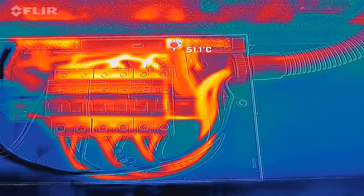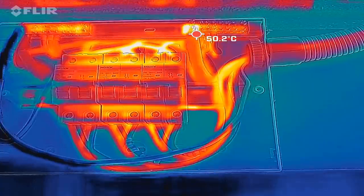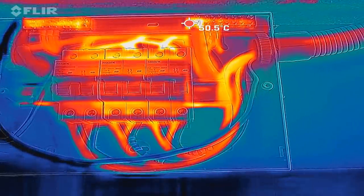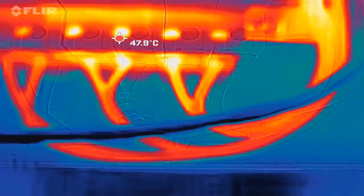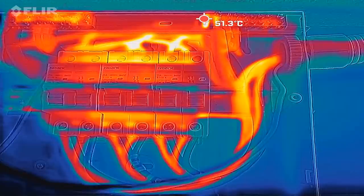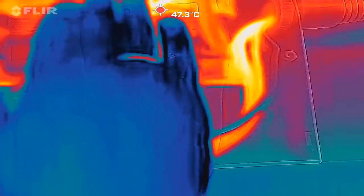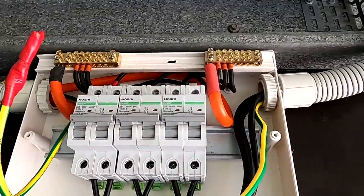This is the combiner box in the carport and we can see a hot spot of 50 degrees where the positive red cable is connected, which goes to our isolator inside the garage. The fuses seem to be all right. A bit hot at 47 degrees but that seems okay given we've got already 35 degrees outside. Maybe an insulation panel here at the top will help. The hot spot is definitely the positive cable going inside the garage — 50 degrees. I think this is still okay; they're warm but not like the 80 degrees we had inside.